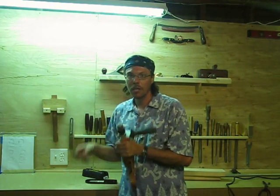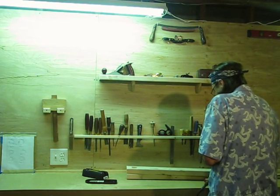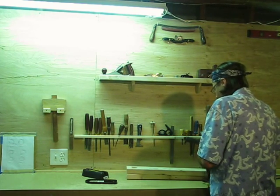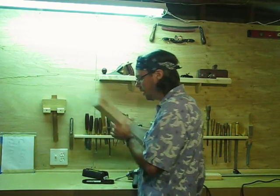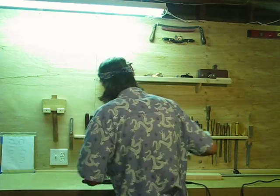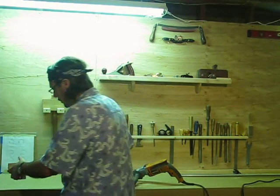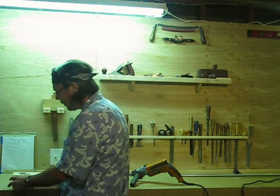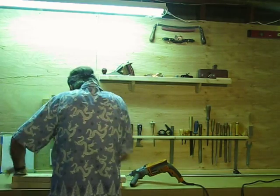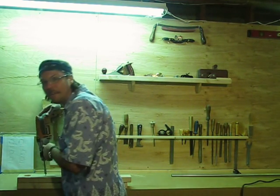Take the hole saw out, put the spade bit in. You need to think about your fulcrum a little bit — you want it to be closer to the magnet hole than to the handle. Probably up around here would be good, like maybe four inches from the magnet hole. That sounds plausible anyway. The magnets just totally magnetized to my drill chuck — that's the annoying thing about super high powered magnets. You stick the magnets in the hole; you'll hold the boards together while you drill them. Pick a hole for your fulcrum, about five inches off the magnet hole, and drill it.